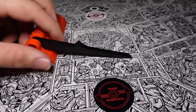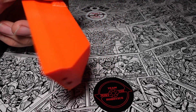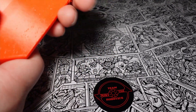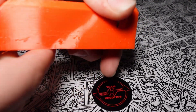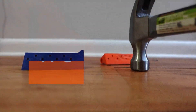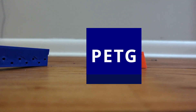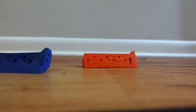This whole wedge is made out of Cheetah TPU — a 3D printed TPU filament which I got off Amazon for about $55 a kilogram. I'll include a link in the description. This stuff is great because it's stupidly flexible and therefore can take impacts and hits really well. Even with this fork here, this can bend significantly without coming apart and will continue to just go back to its original shape more or less and remain strong.